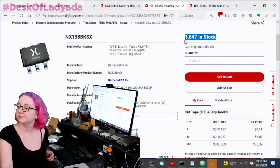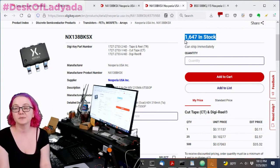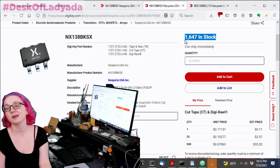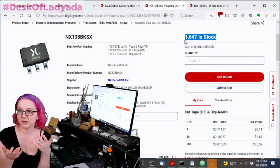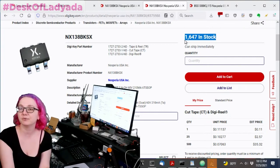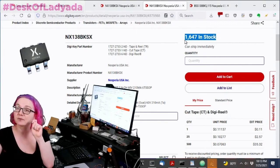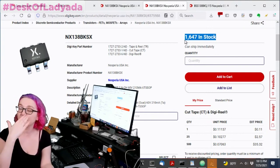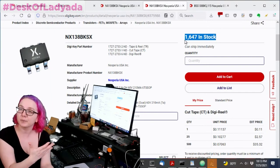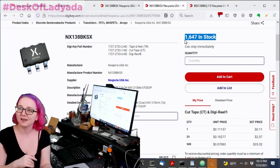Right. So they have a question: since there are pull-up resistors on the board, I assume I don't need to add them. You don't. We put very weak pull-ups, 10K, which is good for 100 kilohertz I2C. If you want to run 1 megahertz, I would recommend adding another one. But 10K is a nice balance: you're not going to hang your I2C bus. It'll run at 100 kilohertz or 400 kilohertz, which is what most default buses run at. Also, if you put multiple of them in parallel, because you plug in multiple QT boards, up to 5 of them, you'll still only have a 2K pull-up. That's what it'll look like to the host, which is the standard pull-up size. So what I like is you can put like 5 to 10, and the host won't get overburdened by the pull-up. So I like 10K. I'm like a 10K kind of girl.